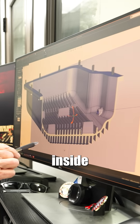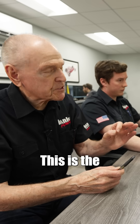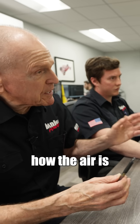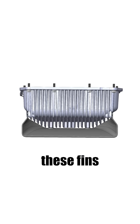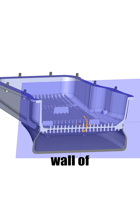Fins connect from the inside to the outside, so there's a direct heat path. This is the key element. It's the Ram Air Scoop. You'll see how the air is gathered up by the scoop. Here's the actual flow area through. You can see these fins angling down and this surface angling up. We're through the front wall of the pan.